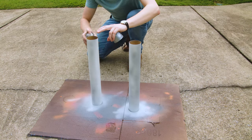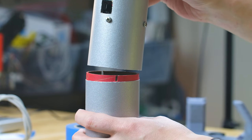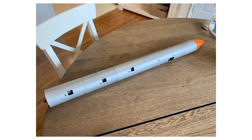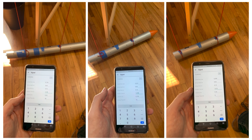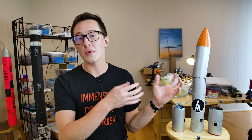The airframe for this rocket is made of 66-millimeter tubing painted in a shiny silver. The first two stages are just about as short as I could make them, and they have a very limited coupler section in between. Before going out to fly, I measured mass, moment arm, and mass moment of inertia for all three stages, second stage flight, and third stage flight. I took those values, ran them through a simulation, got control sensitivities for the rocket, loaded the new code, and then went out to the launch site.